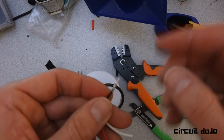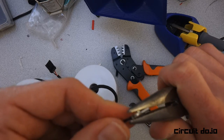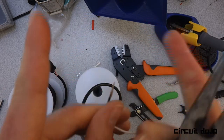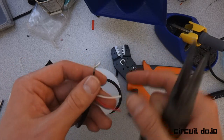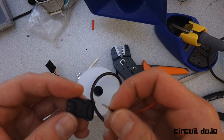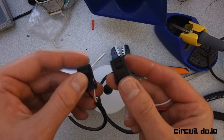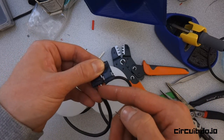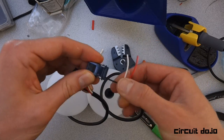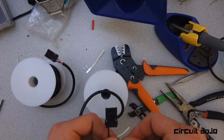Lastly, to make sure it fits into the connector, I'll use the needle nose again to squeeze the sides — make sure nothing extra is sticking out. Sometimes the top of these crimps likes to flay out and won't fit into the connector. This one is looking good. I'm going to test it: the square pieces align with the top, orientation is black, red, then white. Pushing it in — you'll likely hear a nice audible click — and that was it. This isn't going anywhere.